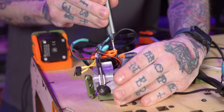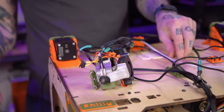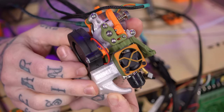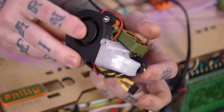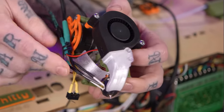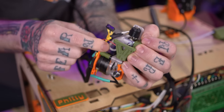With the AB motors swapped it's time to deal with the extruder motor. I have a cable management piece on the back side of the extruder I just need to remove to get the motor off the micro Sherpa extruder. The new LDO motor fits directly back in place — it's a NEMA 14, not a big deal. The part cooling fan duct is mounted directly to threaded holes in the side of the Dropeffect XG hotend, holes probably intended for mounting but I use them for my part cooling duct. I also made an air scoop duct that takes air from the heatsink and ducts it up and away from the print area, across the extruder motor to help cool it — at least it's not blowing down around the print area.